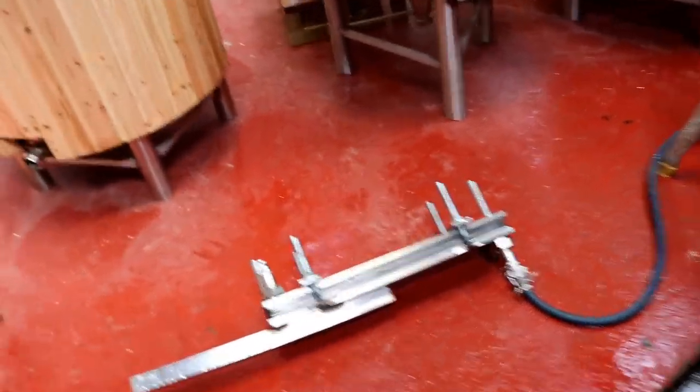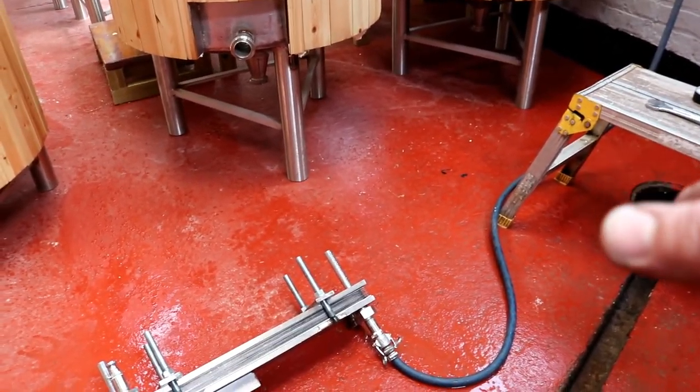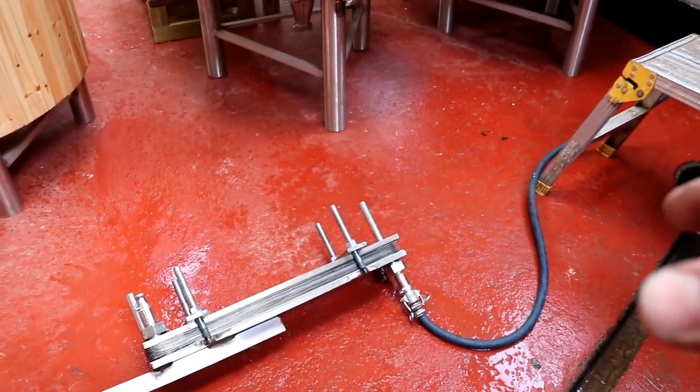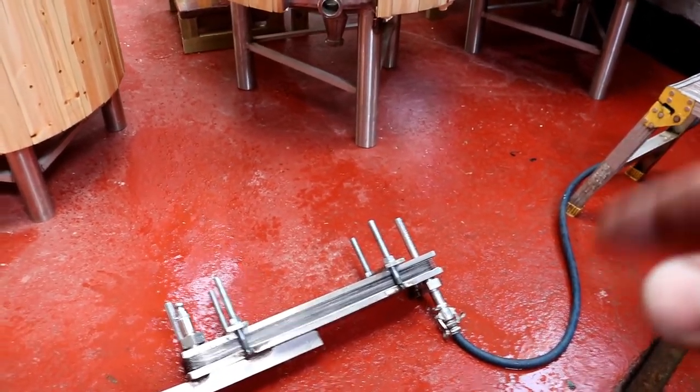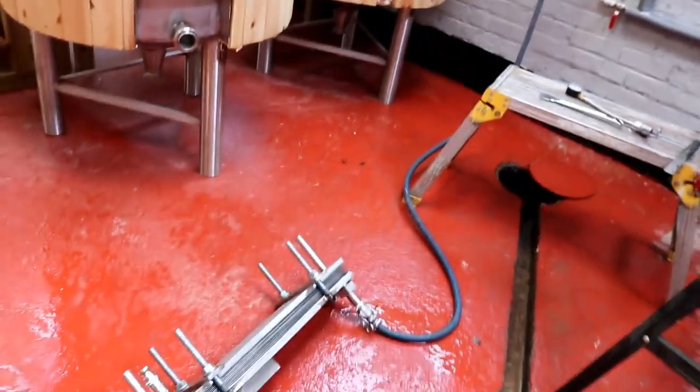Right, that's it for the day. I've got the plates sealed together — got 10 in there, 5 product, 5 water. Got it up to 3 or 4 bar and it was leaking from the product side to the water. So that's going to come off and be troubleshot — if that's the right word. But yeah, I'm wrapping it up now.